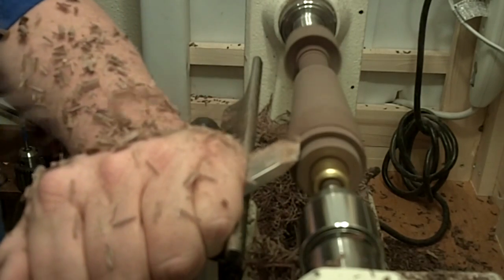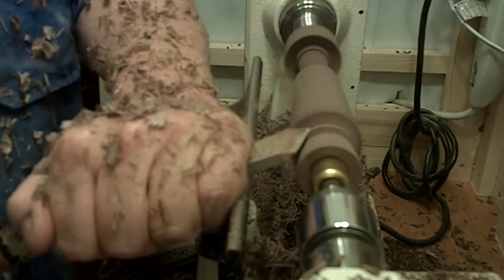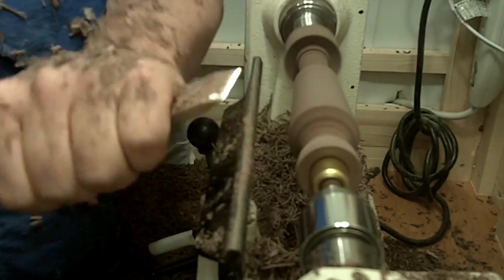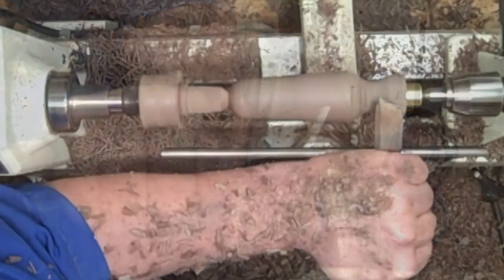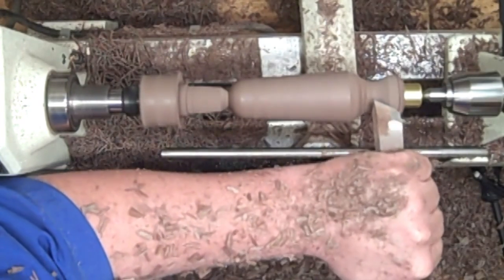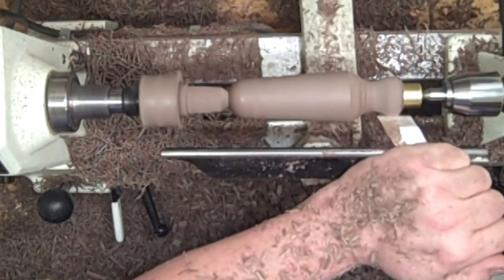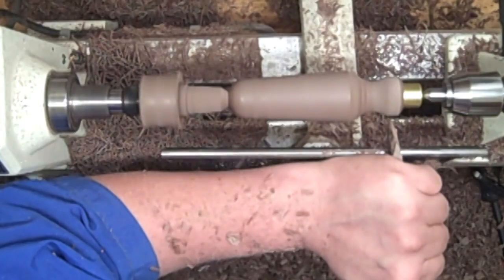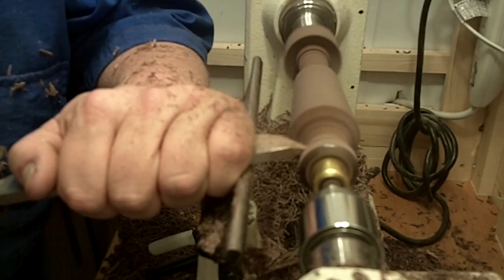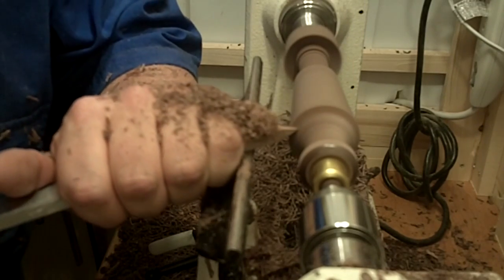I also round the tail section so that when I add the taper in the next step, I'll have a very clean transition line from the gradual taper to the curving of the tail. I use that transition point as my target width for my finger guard in the front. Once I have that width, I come to the front and using a shear cut I eyeball it down to that level. I can then use a scraping cut, approaching from the center point forward and raising up until I get a cutting action, then using an arching motion I cut out the cove for my fingers. Because this is a scraping cut, I can go uphill in the cut. Then alternating between beading cuts and the scraper, I define the shape of the finger guard, going back and forth between all three to blend them together.